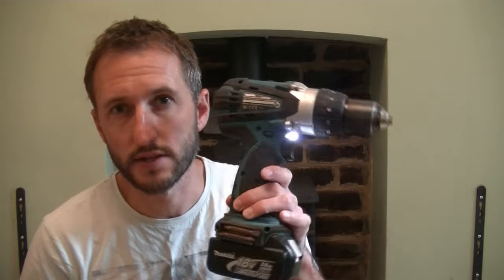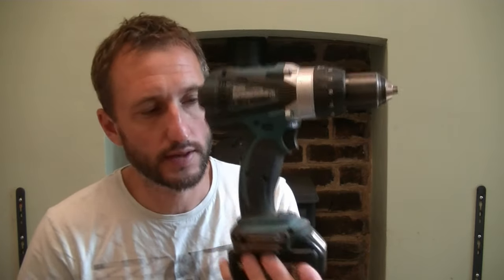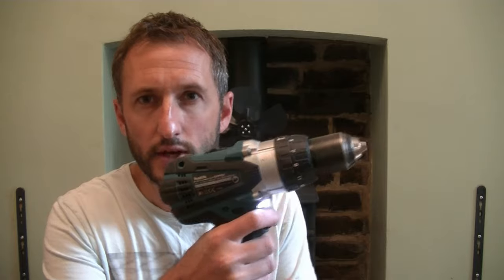In addition to the kit, you're going to need a drill. Whilst you could use an electric power drill, they're a bit overpowered and some don't have a forward and reverse function. On a battery-operated drill you can feather the speed, take it nice and easy, and make sure you don't damage the flue. Going up the chimney in forward rotation, then coming back down in reverse means you're getting a good clean in both directions.